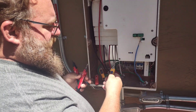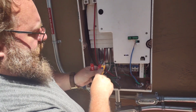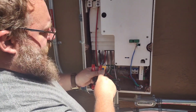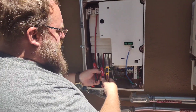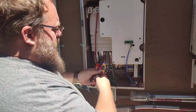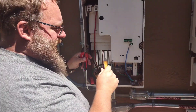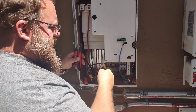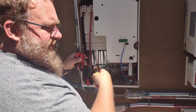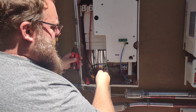The other thing I don't like about this one is you have to manually select voltage range. This dual voltage model goes from 12 volts to 1,000 or 70 volts to 1,000. The Milwaukee version goes down to 10 volts, which I think is a little better. Remember, this is only AC — it will not work on DC voltage. It detects capacitive electricity, and there are plenty of videos explaining how these work.